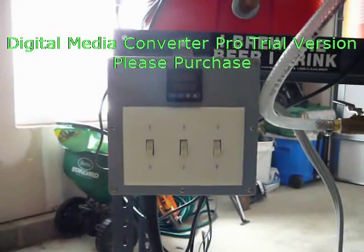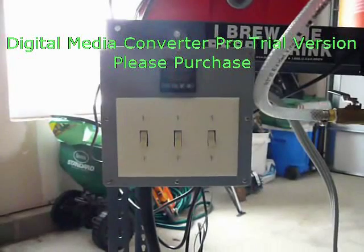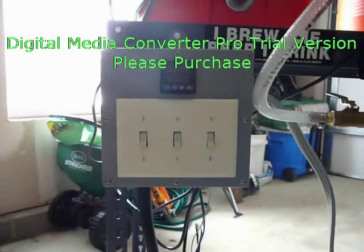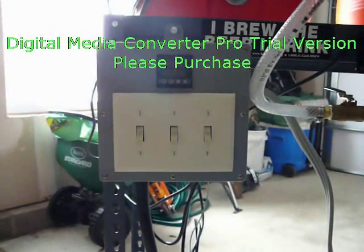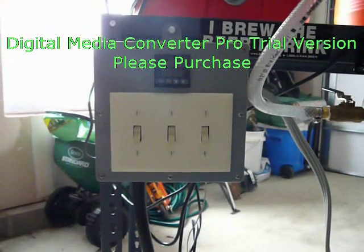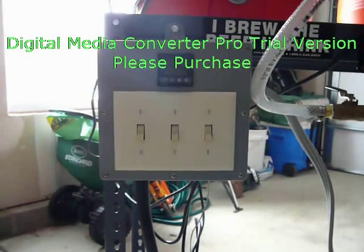The PID on there, that's 120 volt AC. The switch on the left hand side and the switch on the right are both 20 amp single throw switches. Those are used to control the hot liquor tank on the Johnson A419 controller on the left switch, and on the right switch we have the March 809 pump.